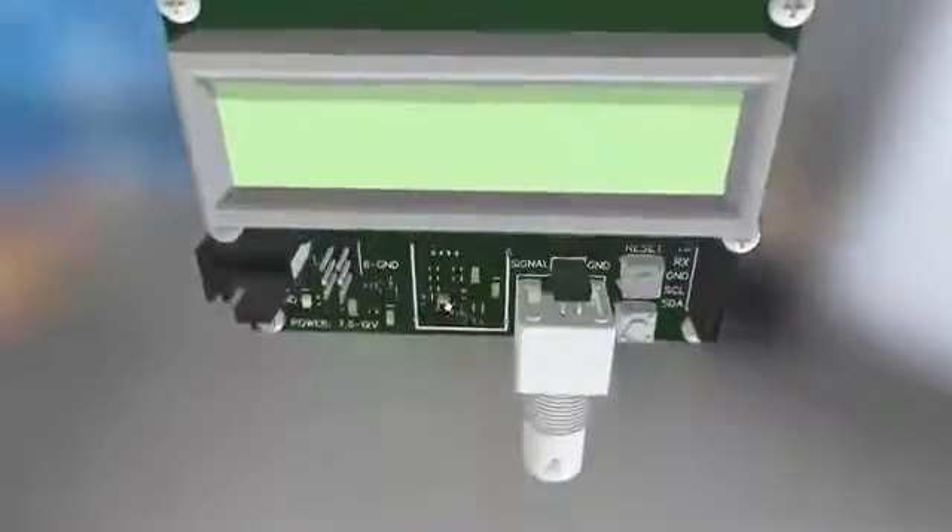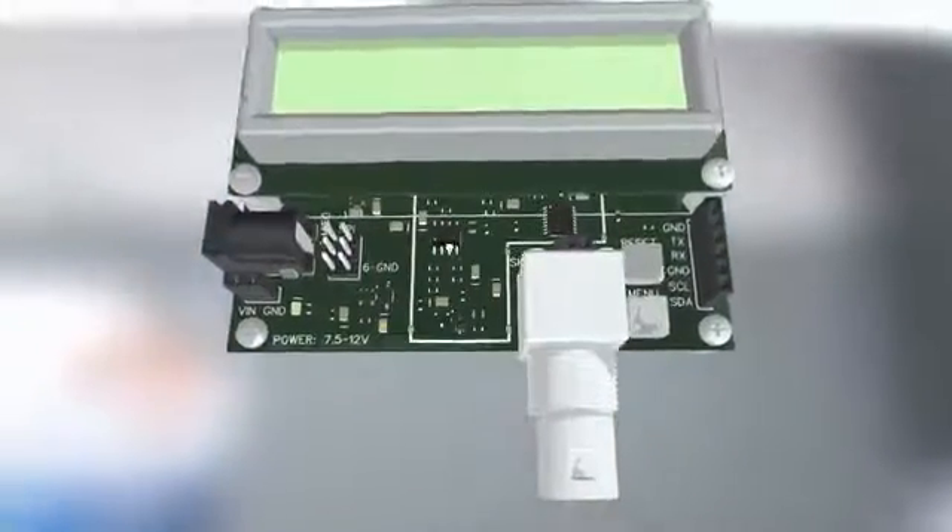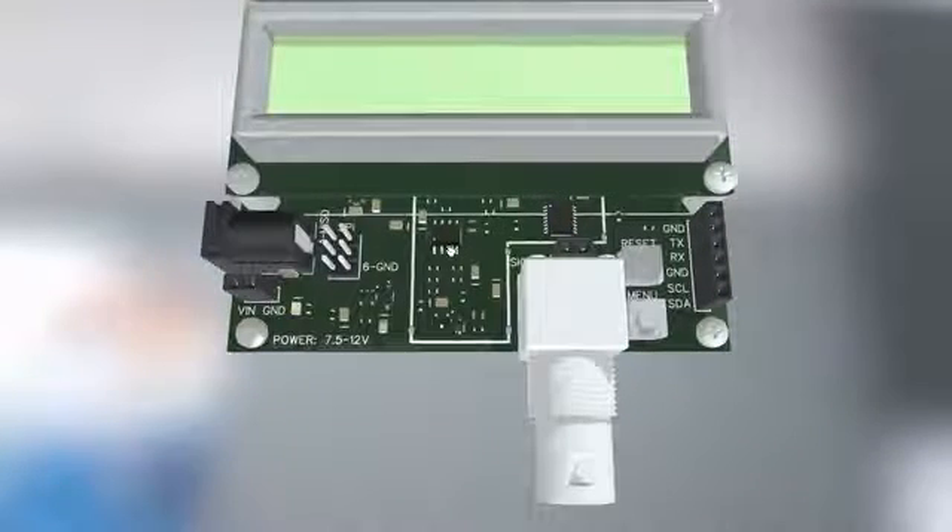This compact board will allow you to measure a wide variety of signals, ranging from less than 5Hz to more than 70MHz, with amplitude ranging from 500mV to 10V and a precision of 50 parts per million.